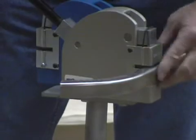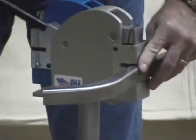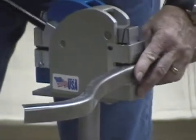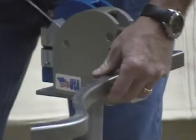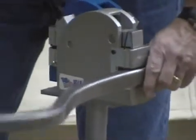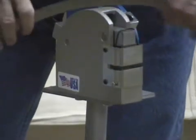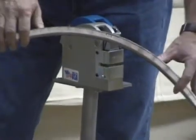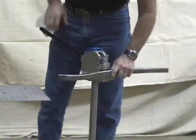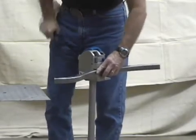Always leave a little bit of room between your material and the front of the jaw so it has room to work. The stretcher works a little slower than the shrinker. You might use this if you're a car guy — around your wheel well, trunk, custom car roof line — anywhere you need a nice gradual curve. Space out your stretching so it gives you a nice round arch. See how you have that nice wide arch? Here we were shrinking; here we're stretching. You can also do a tight stretch by working it in a tighter area to get a tighter radius.